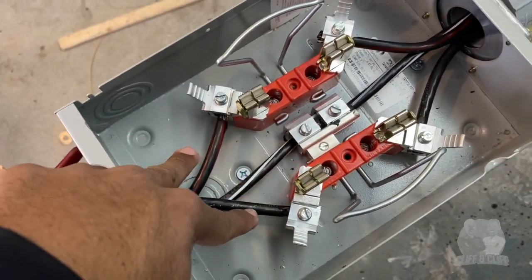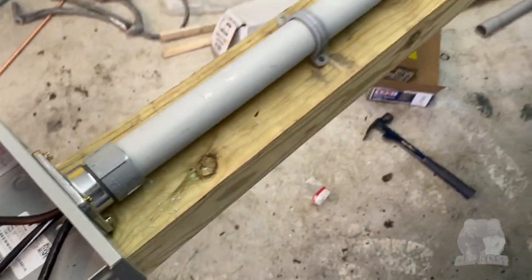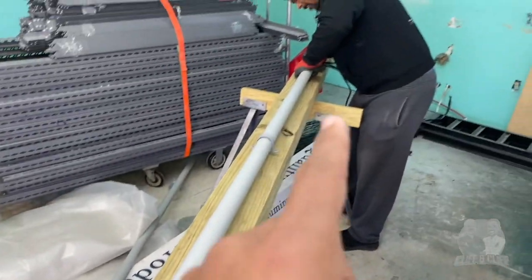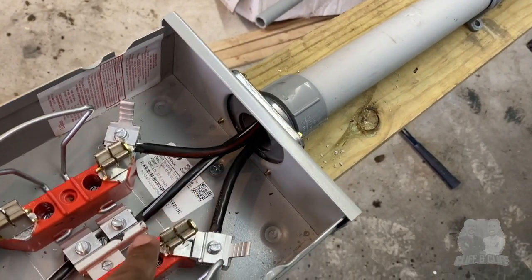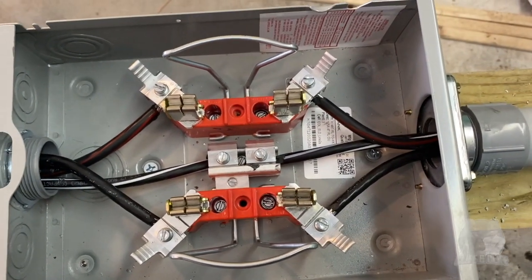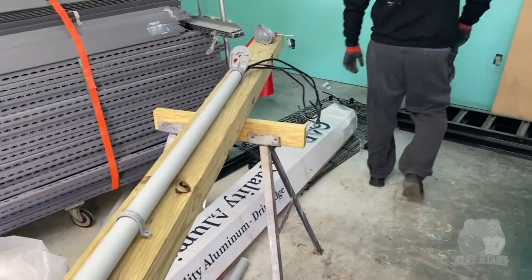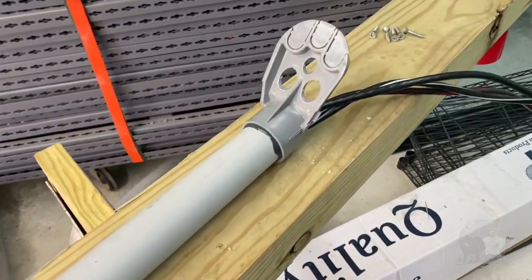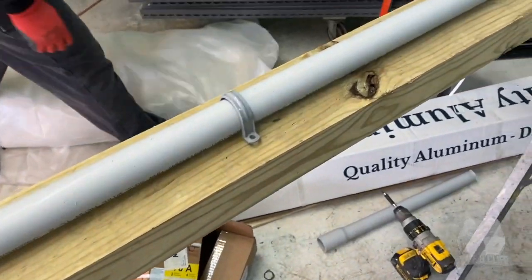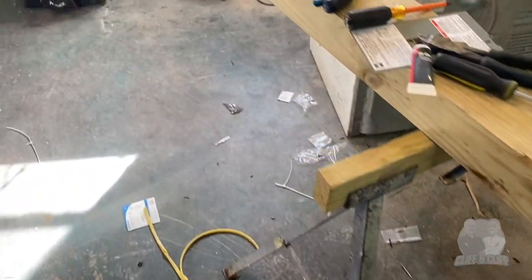All right, so we are all wired up now. We got our neutral wire and our 2 hots, and we just replicated the same for our riser head. We pushed our wires from that end on down our conduit. Got our neutral and our 2 hots. Just connected those. Put on that anti-oxidation compound on those 2 wires as well. And so now he just glued on the weather head. And now we're gonna screw down the conduit. And so the next video you see is us putting this bad boy in the ground.